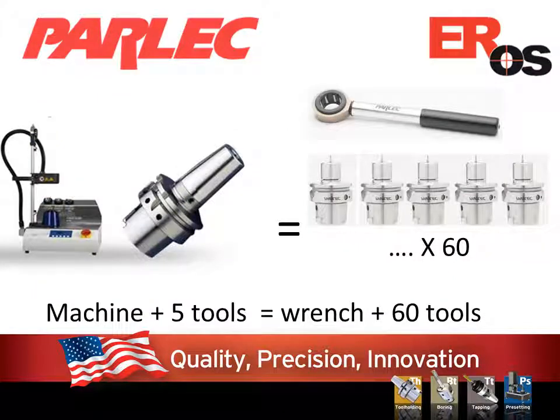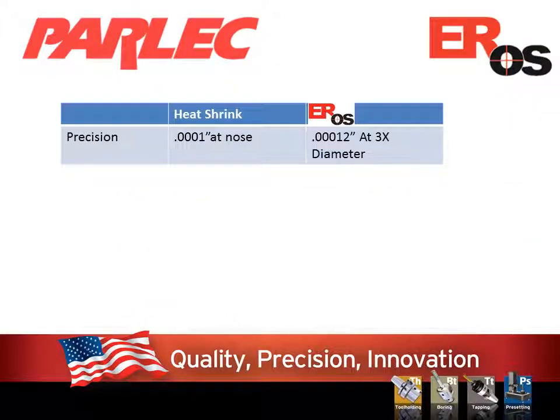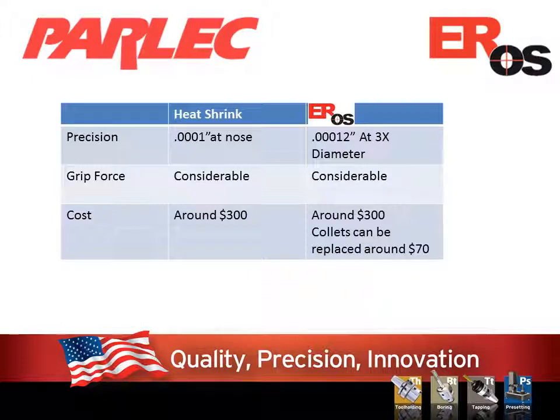Let's look directly at some of the competitive benefits of ERos as it compares to heat shrink. The heat shrink tool has very good precision, like the ERos. It has considerable grip force, like the ERos. Cost is similar, but remember, you can resize an ERos with a new collet, and you will need a whole new tool with heat shrink. That one goes to ERos.